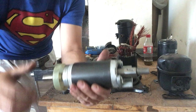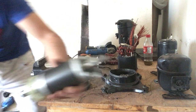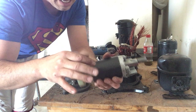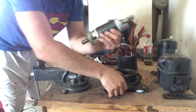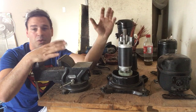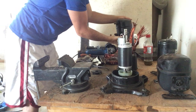On top of the motor, you have this piece — the motor will sit on top of it. This actually has cast aluminum on both sides. I can bring this in as dirty cast, which weighs about six pounds. Dirty cast is not worth much — it's about five cents a pound — but that is an option. Or you can throw it into your steel pile with the rest of the frame and get steel price. Steel right now is about $259 Canadian a ton. Some people will cut this cast off, but in my opinion it's not worth it because it's not very heavy.